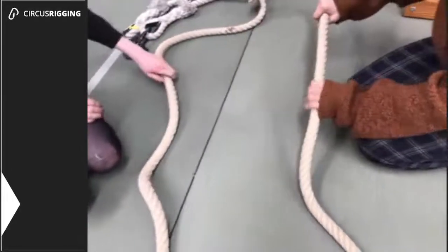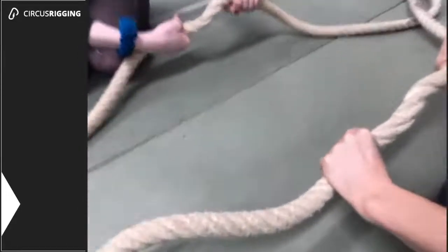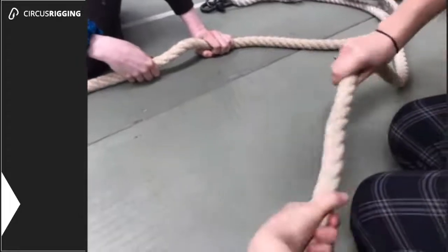If you follow the rope up to sort of mid-length, where you can easily get hold of it, grab it with both hands and then twist in opposing directions to open up the lay. Not much, because you don't want to put a hockle in it. You want it to go back afterwards. But just open it up so you can see inside the strands. You might need to move your hands close together. That's it. There you go.